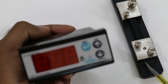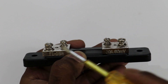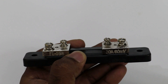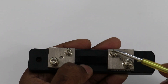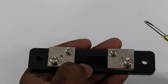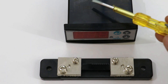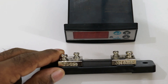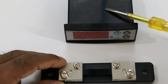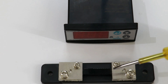The shunt I have has a value of 30 ampere, which means 30 ampere current can flow through it. After this, 60 millivolt is written here — it means the voltage on the wire connected from this shunt to the ammeter must not exceed 60 millivolt. If more than 60 millivolt flows then this ammeter may get damaged. So whenever you go for connection of a DC ammeter, you have to be careful regarding the value of the shunt.